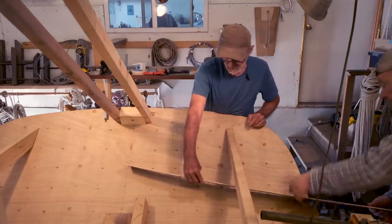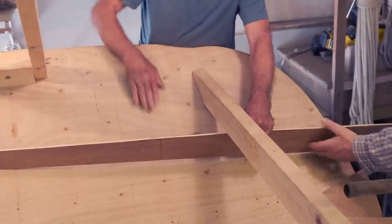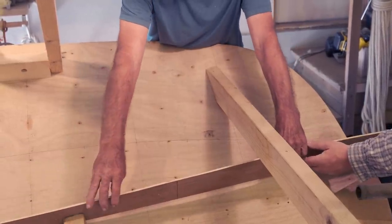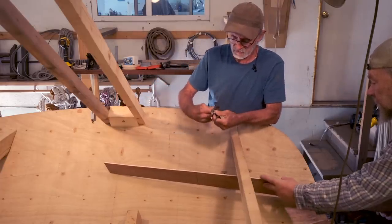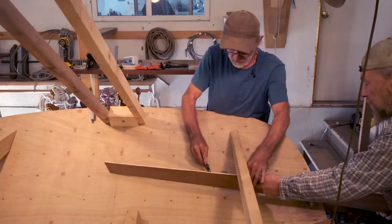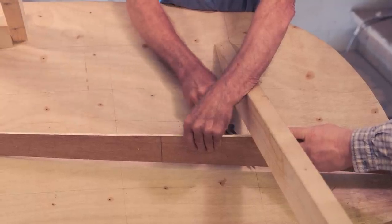I've got Ken over here on this side holding the piece. We're going to get past the center line a little bit and stand it up. Now it's 90 degrees to the transom itself — that's the way you have to take this curvature. It's also on an angle; we have no reason to cut it straight across the pattern. This is the way we want it, just like this. So basically all I'm going to do is take a pair of dividers, set it a little bit wider, just about the space at midships here, and draw a line right through there like that.